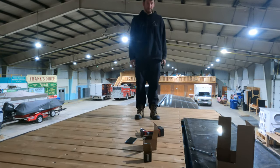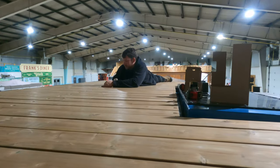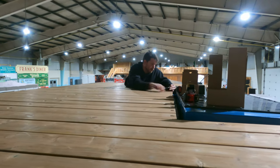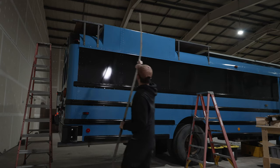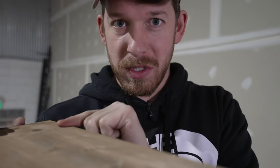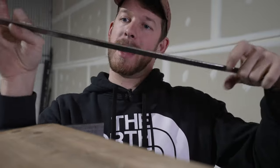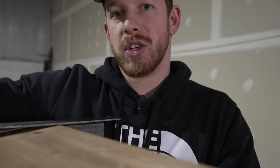She's sturdy, just a little squeaky still. This rooftop deck is far from finished — the ends are not clamped down and none of the metal is painted. I have some flat bar and we're going to make this the top of a sandwich that squeezes all the boards down. We've decided to do this instead of bolting each board down individually.